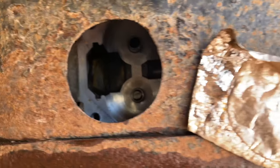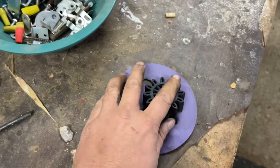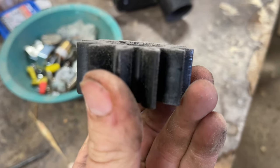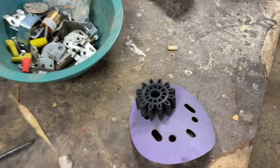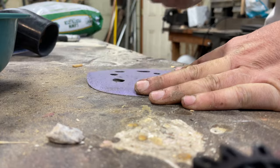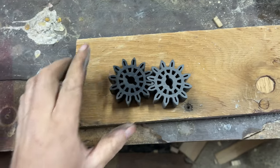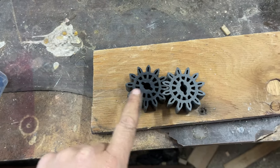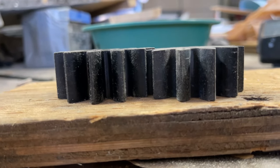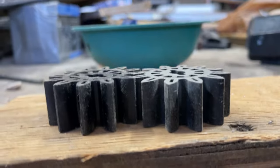There you go, that's what it looks like inside there. We're going to get these in the shop and sand them down. What I've got is some 120 sandpaper — I'm just rotating it around and sanding it down so it gets down a little bit. You just want to take off a little bit. I have one gear that I sanded and one that didn't, and you can see how the other gear is just slightly higher. That's what you want to do — sand this one to match that one and then put it back in and see if it works.